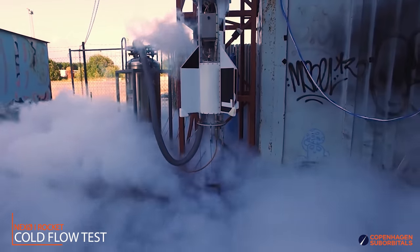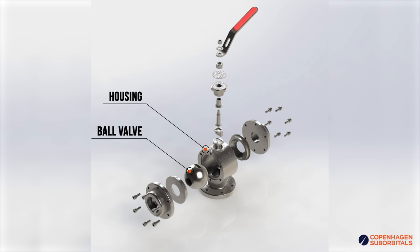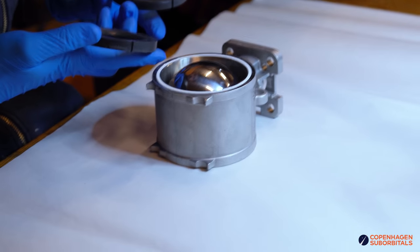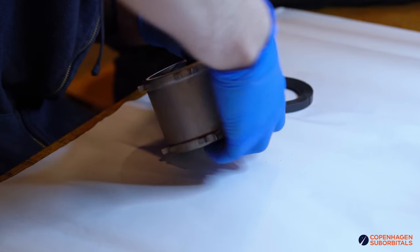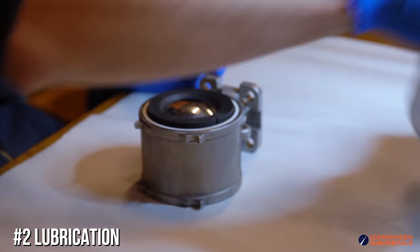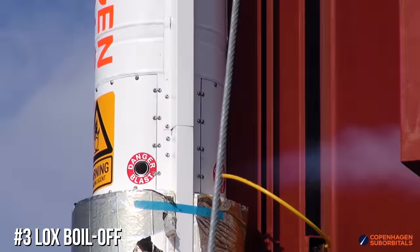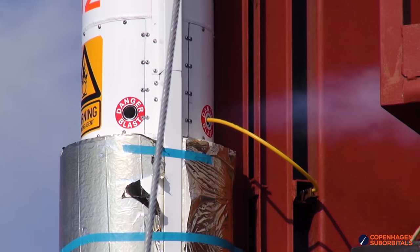Now let's look at the differences and challenges between cryogenic and non-cryogenic ball valves. A typical ball valve is comprised of its housing, the rotating ball valve, its shaft and seals. The first challenge is differential thermal contraction when using minus 180 degrees Celsius liquid oxygen. We need to account for that when choosing the right seal material while also considering how LOX-compatible seals will wear against the material of the valve body. Related to seal wear is the issue of valve lubrication — your off-the-shelf non-cryogenic valve will most likely use lubricants that don't play well in a liquid oxygen environment. The third challenge is managing liquid oxygen boil-off: if some liquid oxygen remains trapped inside the valve once it is closed, it can start transitioning into its gaseous state, expanding by a factor of 800 and building up a lot of pressure, which can lead to an unscheduled rapid disassembly.